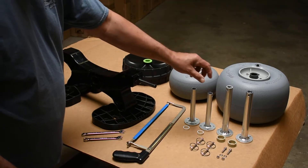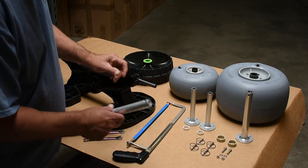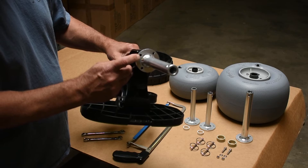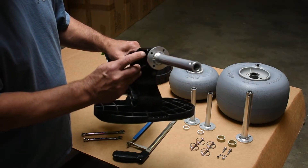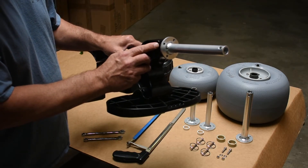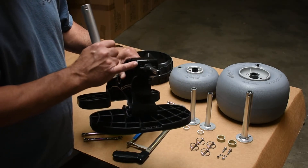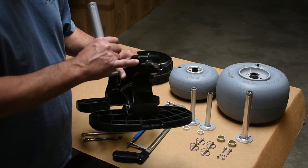At this point, you'll take one of the Wheelies axle tubes, slide it over the existing Sea Tug axle, align one of the holes in the axle with the Sea Tug frame in this location, make a mark on the Sea Tug frame, remove the axle, and drill a quarter inch hole, which has already been done.